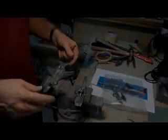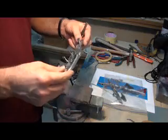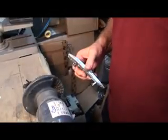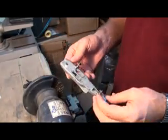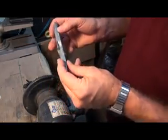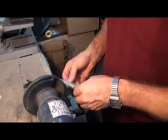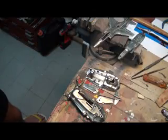And all that needs is a repair to one wheel. I've got to repair this wheel on the lower casting. There's a repair to do on the top casting as well, and then I'm going to buff these up. Back from paint stripping, I'm going to use this bench grinder with a wire buffing wheel just to remove any excess paint, corrosion, dirt and grime and so forth, and polish up the surface to make it much easier to paint with. Remember to use a grinder with glasses.